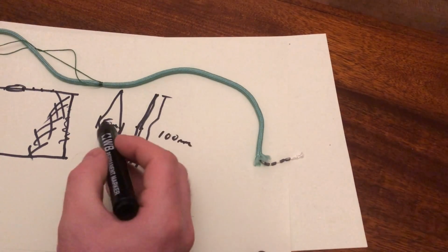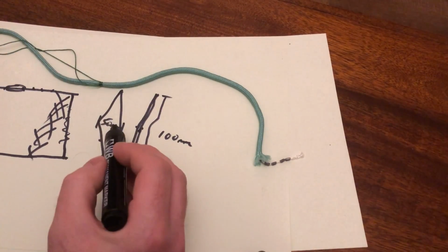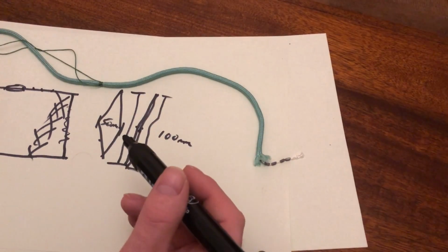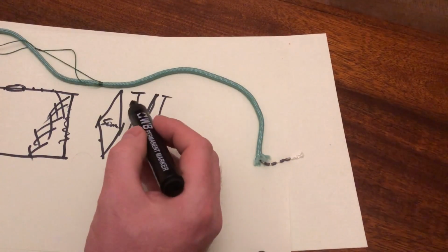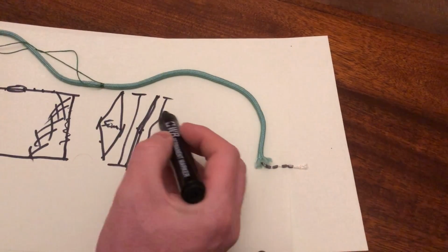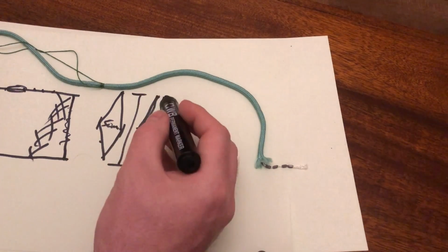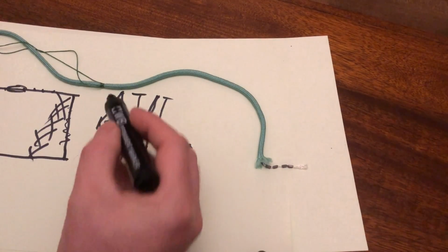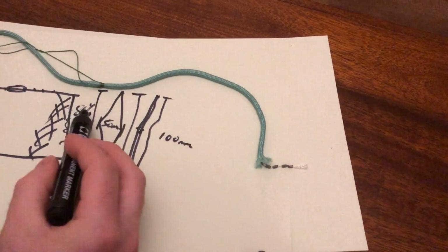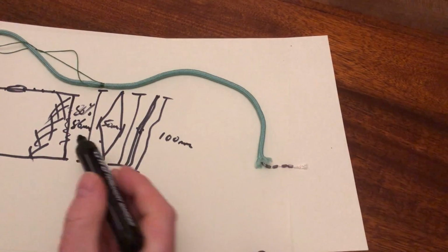But if you increase the gap between a closed mesh and a 50% open mesh, that then decreases the height. I think in math terms, if you do it at 50 mil, the height is actually 86% of the full stretch mesh. So a stretch mesh is 100 mil, you open it up by 50, and that height across there is 86%. So 86% of 100 is 86 mil. With 100 mil mesh, that makes it ever so easy.